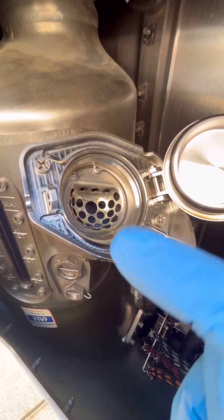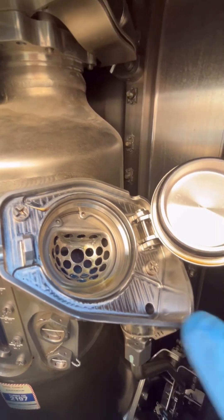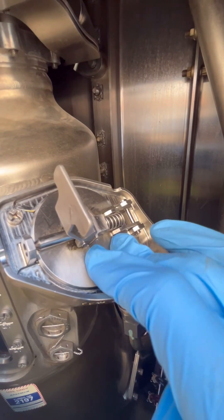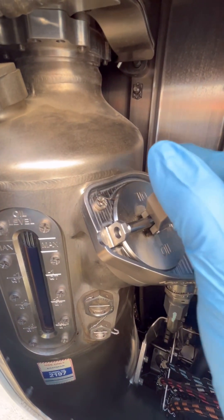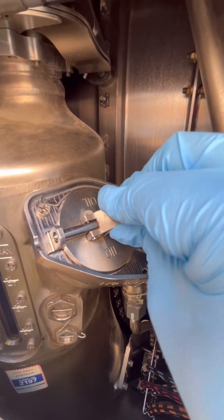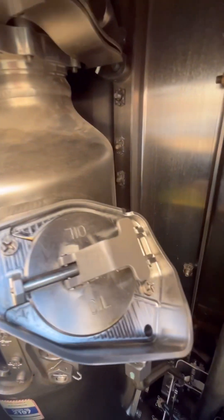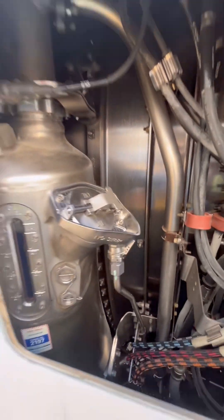Our oil servicing is complete. The oil level is within the marks and you can see the oil through the screen — oil is good. We do one last quick inspection before closing the oil cap, then close and lock it, making sure the cap sits properly. Give it a firm press and our job here is done. As good maintenance practice, have a quick look around at the cables and oil lines to make sure everything is in good working order, then close the panel and go up to the cockpit.